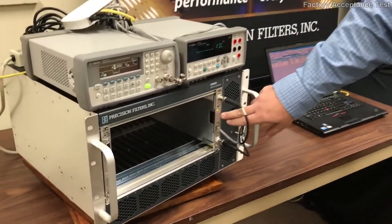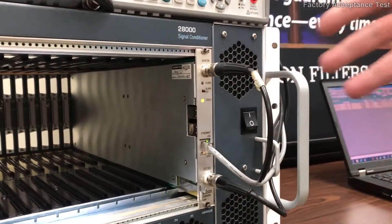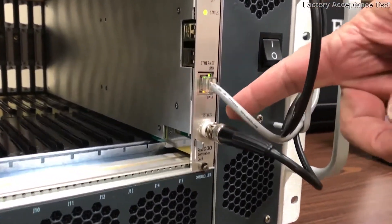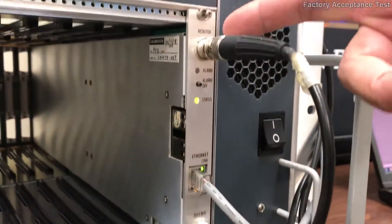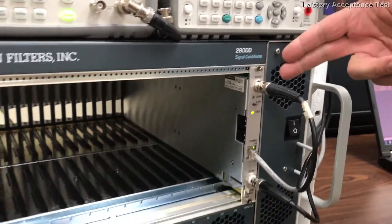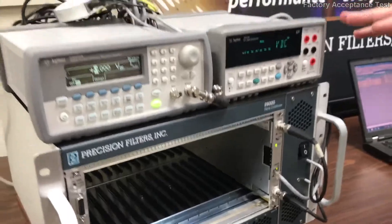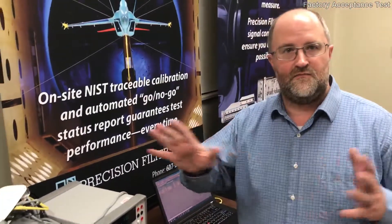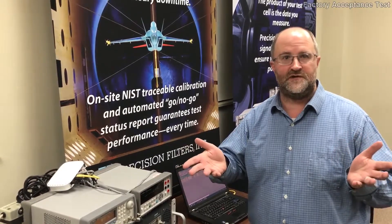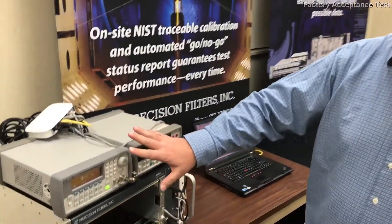The test system consists of the 28000 BIF control card, which provides the Ethernet interface to the PC. There are also test circuits on the BIF card that work in conjunction with the test bus function, which we use to inject signals, and the monitor function, which allows us to tap off any single output of any channel and monitor it with our BIF control card. We can view the output of any channel in the system, teed off from the output going to the digitizer, so we can look at data from channels in real time without affecting the output going to our digitizer.